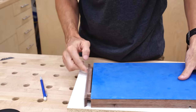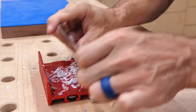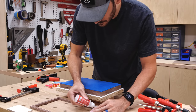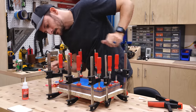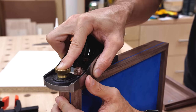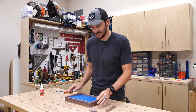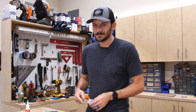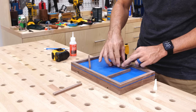After a night in the clamps, there was a little rubbing on the drawer as it opened, so I cleaned it up with a card scraper to hit any high spots. Then I sanded the epoxy flush with the sides and scraped down the monogram. I attached the top frame with CA glue since it cures fast and lets me keep working. After 15 minutes in the clamps, I flushed up all the sides using a block plane — as soon as I saw wood and epoxy come off together, I knew I was flush. Final sanding will take care of the rest.